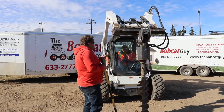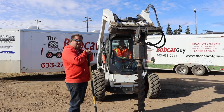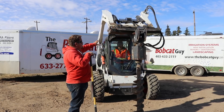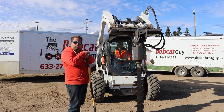When you're working around equipment like this, you always go back to video number one — eye contact with the operator. There'll be links in this video for that. You want to make sure you're watching him at all times and that he is watching you plus the equipment. He's going to be on the trigger at all times so if something happens he can shut the motor off right away.